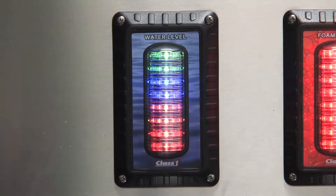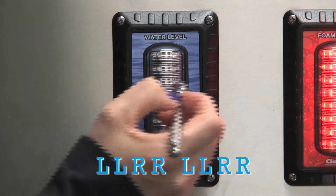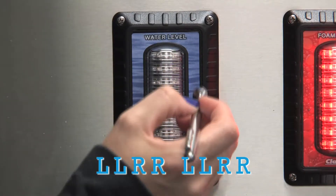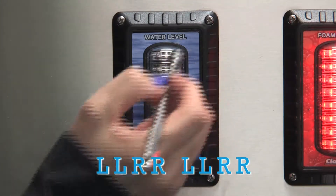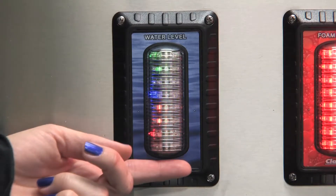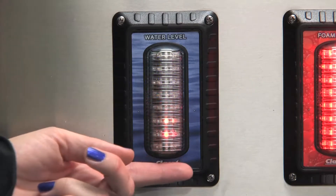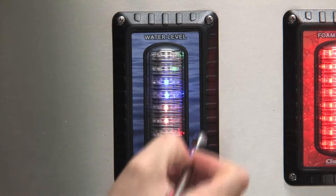To check your ITL-40's voltage, you're going to enter the sequence: left, left, right, right, left, left, right, right. It's now going to display 'volts' and give you a number — 4.26 in this case. It's going to keep scrolling the number so you have time to write it down. If you want to get rid of it, just activate the write switch.